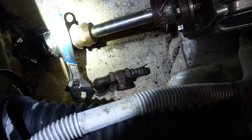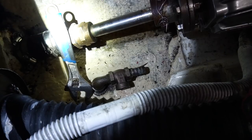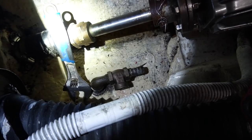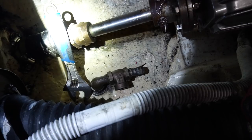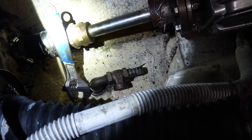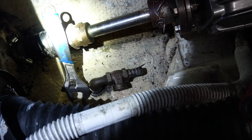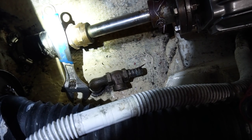So that's the through-hull seacock right down there — it just wouldn't spin around, so I had to take out the little gate valve nub so that it would spin around, and now I can actually take it off and replace it with a ball valve.